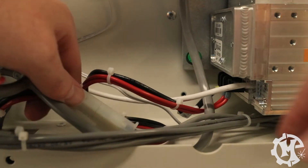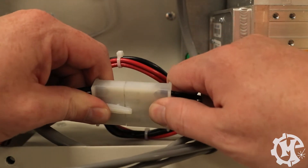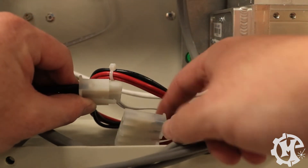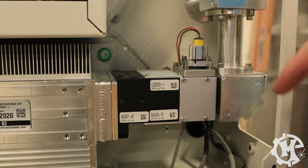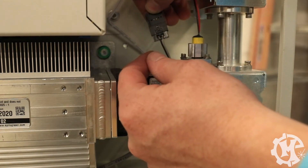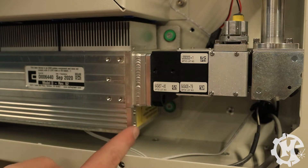I'm going to start over here on the left-hand side. You should see a cable that looks like this that is red and black. You'll also see this clip right here — what you need to do is actually press down on the left side and pull this cable apart. This cable may be a little difficult to get apart, just make sure that you don't break the clip that is on this left-hand side connected to the machine. Next, underneath the tube, you'll see a cable that looks like an ethernet cable — go ahead and push up on the clip and slide that out of the tube. Now over here on the right-hand side, we have the red dot pointer cable. You can see that there's a black connector — you may have to pull it up to get access to it. On this clip, you will see a little black tab here; you need to push this down and then separate that cable. Now that you've got the cables disconnected, you're going to have to loosen the green capture screws. There are a total of three: two on the right side and one on the left.